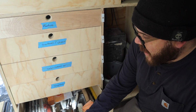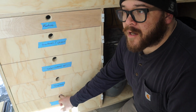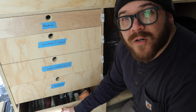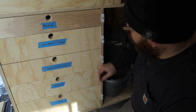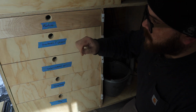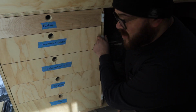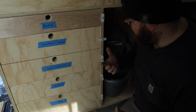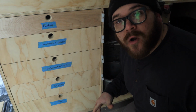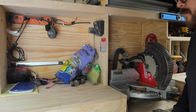All of these things glide on a runner, 2 runners, made out of high density polyethylene, which is just really slick stuff, so it moves easily. And then they lock with a little toggle, also made out of HDPE. His system locks on its own, it kind of falls into place. These ones just lock with a toggle, and I haven't had any issues with that. HDPE is pretty hard stuff, so it's terrible to work with. It makes a huge mess, but this stuff works good for this function.